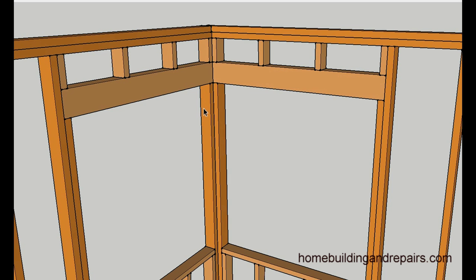I say aluminum windows — I don't even know if they make them anymore; this is 2016. This would be a window with a flange, and maybe a one inch to a two inch, even a three inch, depending upon the thickness of the window and the thickness of your wall framing. It would be something that would stop and not need to be trimmed out with wood.